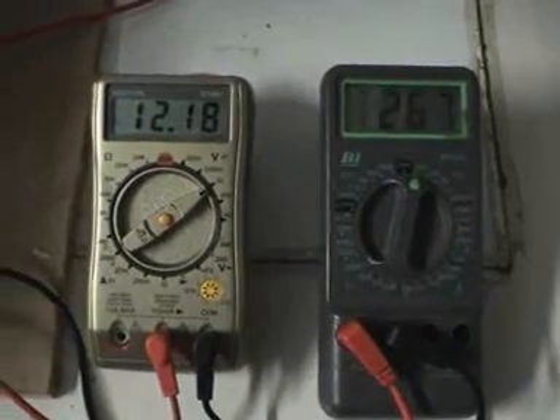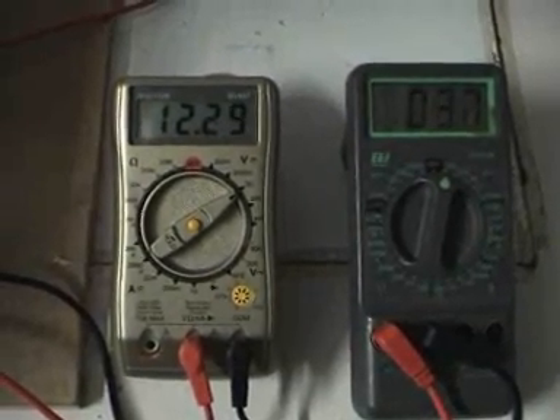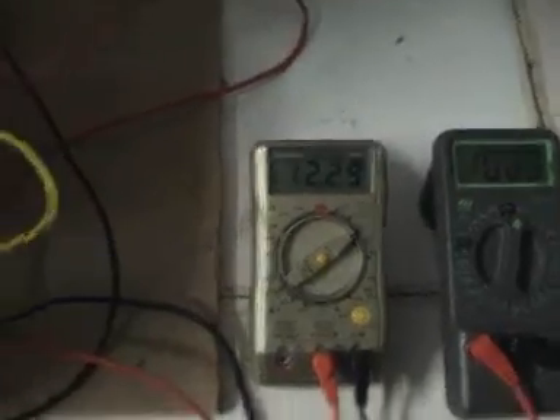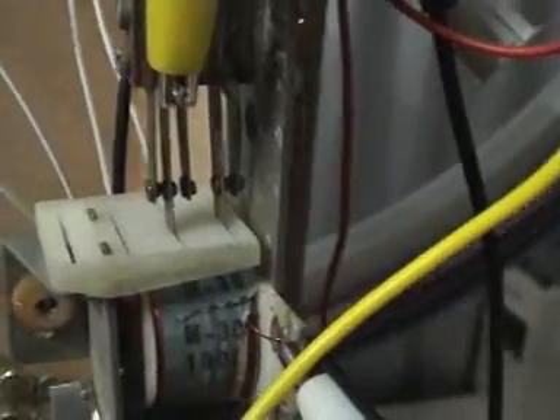And into an overload situation. You can also see the meter on the left is jumping all over the place as well. Not sure if it's charging at the moment. What I've got going here is a reed switch which is getting triggered off the magnet on the wheel, going through to the relay circuit. You can see those sparks there. The contact on the right is the pulse coming out of the bridge rectifier, and the left is cutting the power from the primary battery.